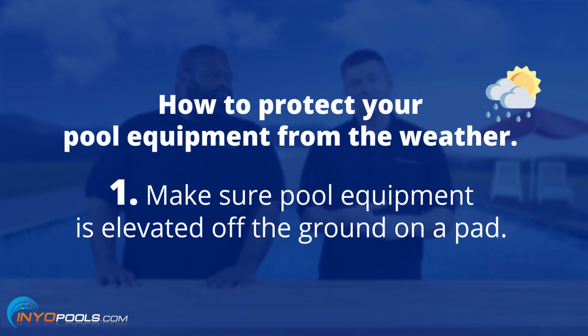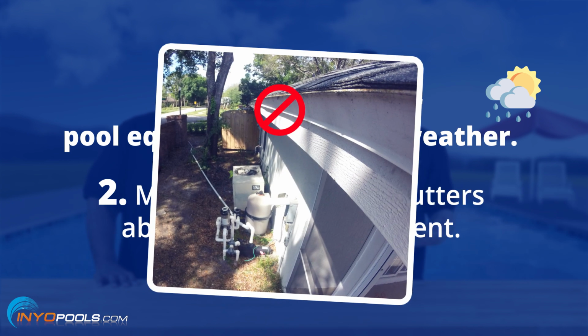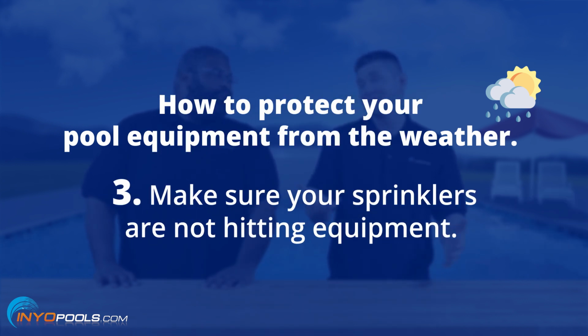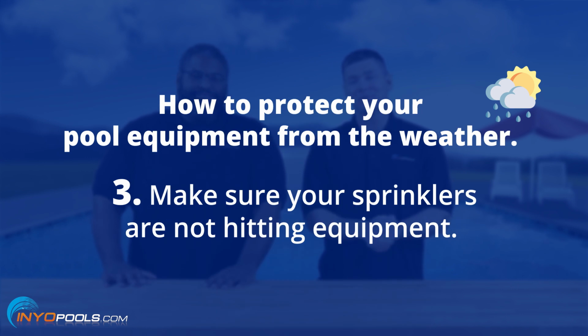Also, you want to make sure whatever side of the house it's on, you have gutters up on your roof so that rain just isn't pouring onto your equipment. You also want to make sure your sprinklers aren't hitting your equipment because water and electric motors never mix. Exactly. So you don't want your sprinklers just constantly running on it.